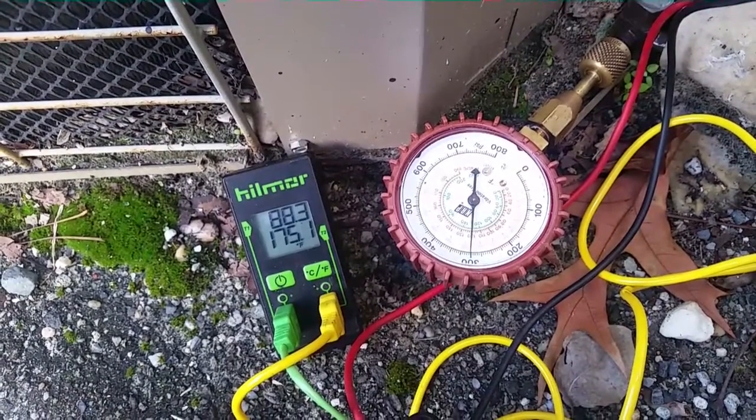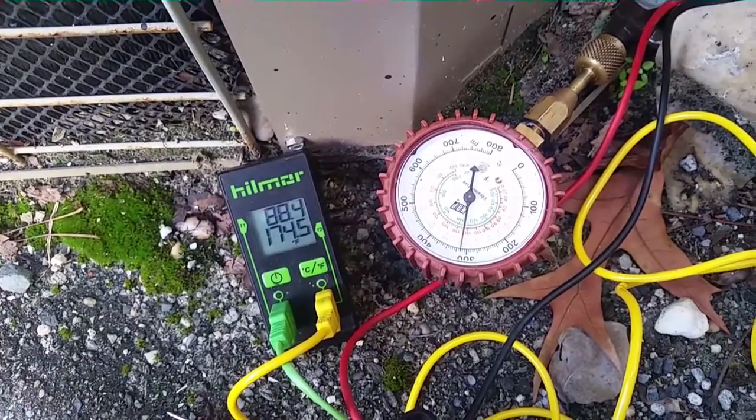Every few seconds it's going to shut on and off. Now it's probably a good thing this Goodman defrost board wasn't there forever, or the compressor would probably already have been toast. The York board having a lockout in it is a good thing in this situation. It helps you when your installers are morons.